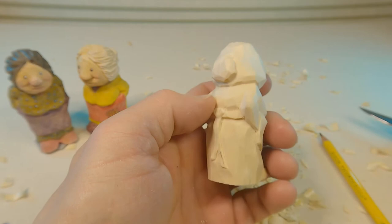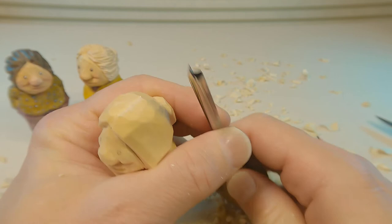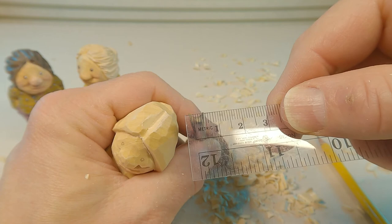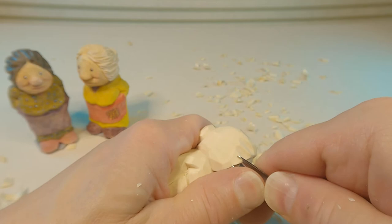In the hair, you can use, here, let me grab a couple gouges. This is a number 9 gouge, Swiss made. Not sure what the size of it is. The sweep is 9, and it looks like it might be maybe 6 millimeter. And then you're just going to basically go in here, take some cuts out of her hair to look like it's pulled backwards a little bit.